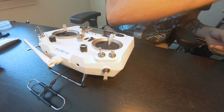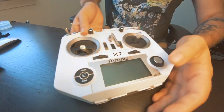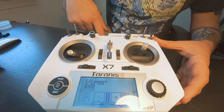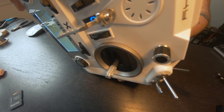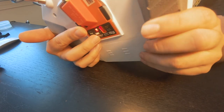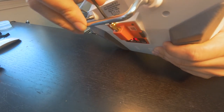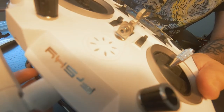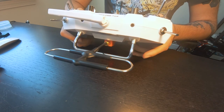One of the first things I started to notice was the fact that the receiver, when I power it on, it's not making any noise from the actual module. When I first got this module it had a really loud hum — the higher the wattage output, the louder it is. Now it's not making any noise, but if I start playing with the antenna you'll hear it. So that was kind of my first hint that something was going wrong with this module or the antenna.